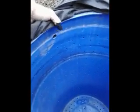Oh, I've put the barrel in the wrong way round. The hole it's got to go in is on the other side, so I've just got to turn it round. That's better. I've got it lined up now, so there's the hole. As I say, I don't think I really need to insulate it, but it does give the pipe a bit of protection in case there are any sharp stones in the ground. The ground here is pretty stony. It will just mean it doesn't puncture the pipe. I've just got to cut a hole in the membrane and put the pipe in.